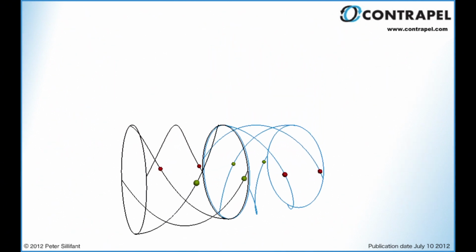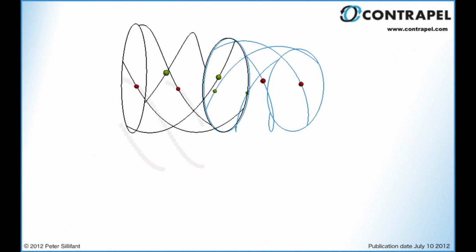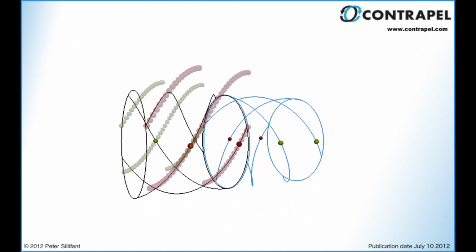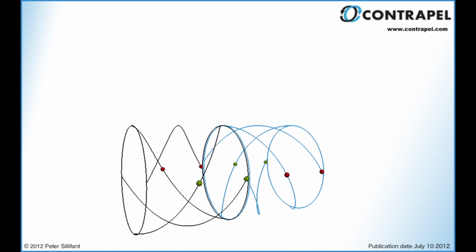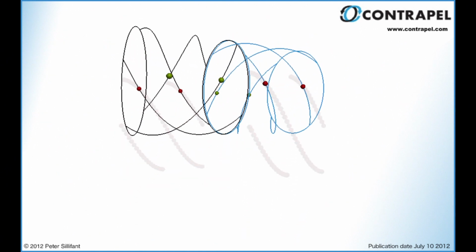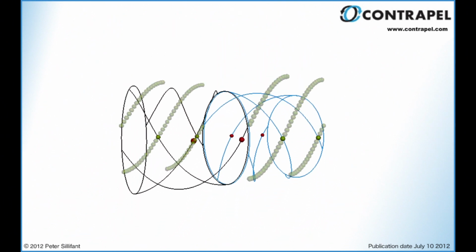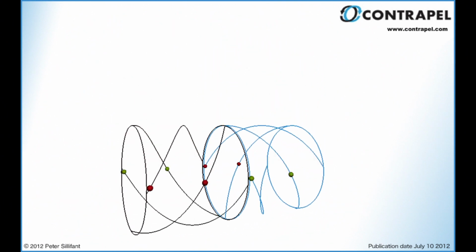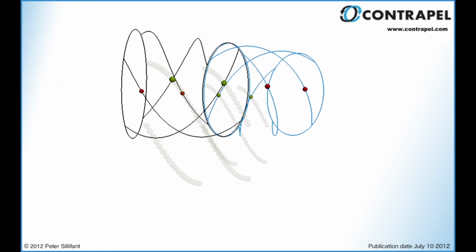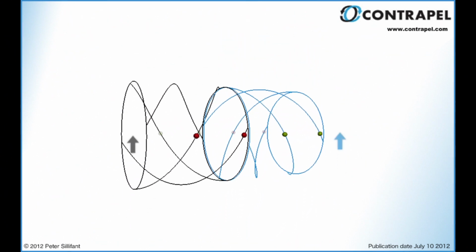Notice too that whenever additive or subtractive oscillation is occurring on the far side of a given propeller, let's say the upstream propeller, the opposite form of oscillation is simultaneously occurring on the near side of the same propeller, while the near side of the downstream propeller is undergoing the same form of oscillation as the far side. These also switch rhythmically back and forth. All this switching occurs as the oscillation moves through its top or bottommost points and then changes direction.